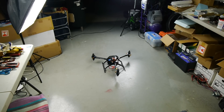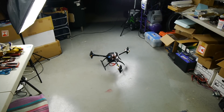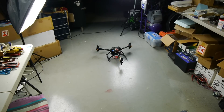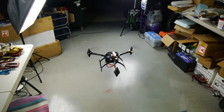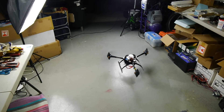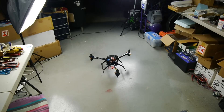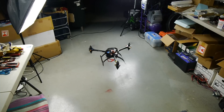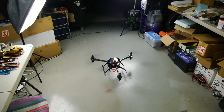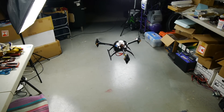See, I never moved the throttle at all — it just settled in and reduced the throttle. I don't know how it knows it's close to the ground. I'm seeing a little bit of jittering, so I presume my gains are maybe a little bit too high.